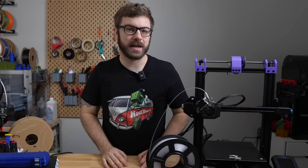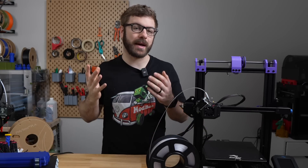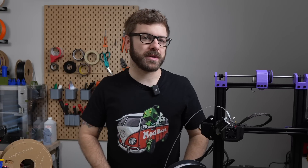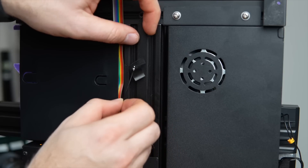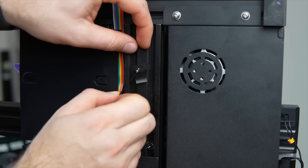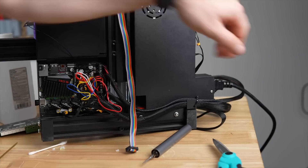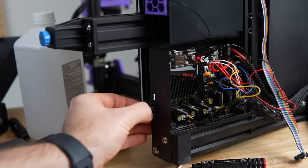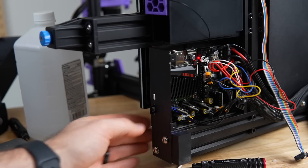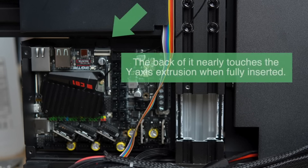At this point I was pretty excited, so I closed up the bottom of the printer, flipped it over — and this is when I ran into a big problem. After closing the bottom, I noticed I was having a connection issue, which I originally thought was maybe the CB1 or its antenna. After playing around with the antenna and resetting it a few times without it showing back up on my network, I figured that probably wasn't the issue. Then I thought maybe it was my cheap microSD card getting corrupted — I was wrong. You cannot access the OS microSD card when this board is installed; you have to remove the board to access it.